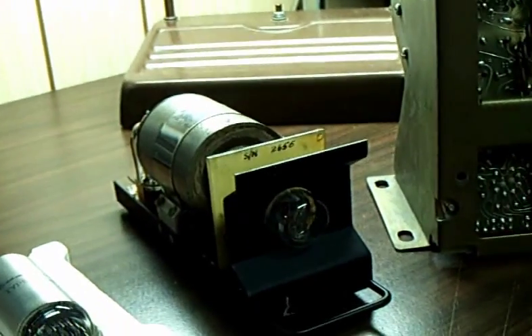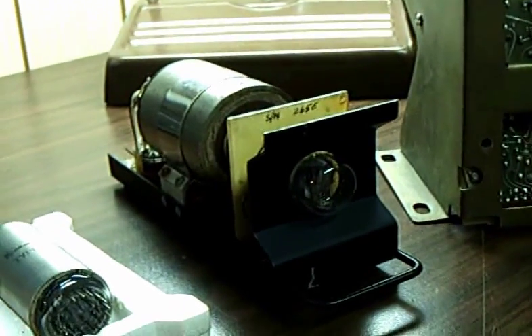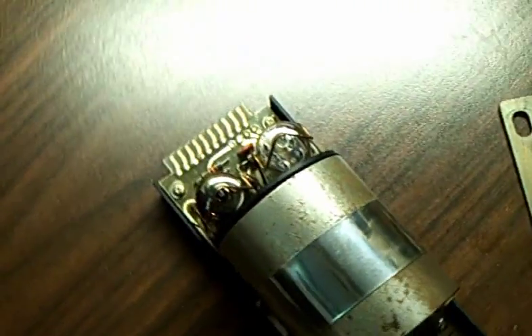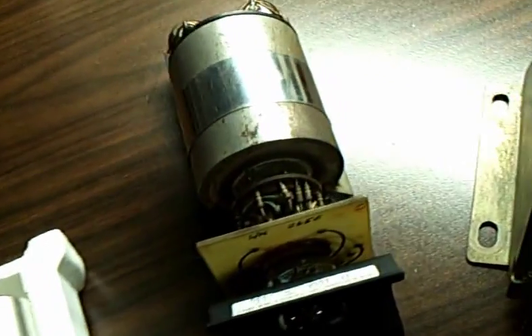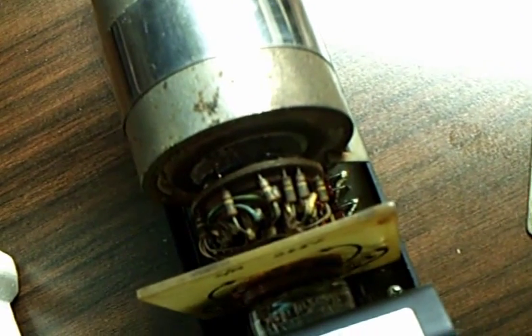Over here we have a couple of beam switching tube circuits — you almost never see these turn up. This is a DC106A decade counter module. That gigantic box right there basically replaces the function of a Decatron, but it has a direct Nixie tube decimal readout. In the back it has a somewhat rusted BD301 and a couple of computer-rated 12AU7s or some kind of triode, and lots of resistors. Those resistors are the spade resistors that make the MO-10R so much faster by putting them inside the tube.